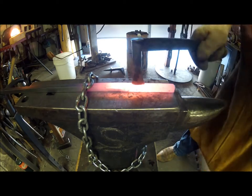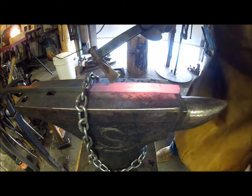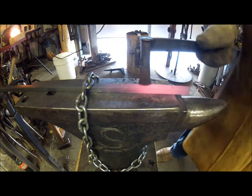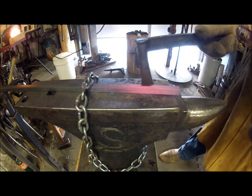This is half inch square bar. That groove is going to be about three and a half inches long and it's going to end about an inch and three quarters from the end. I groove all four sides probably a third of the way through the piece — that way I don't cut all the way through it.